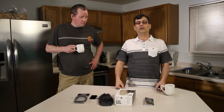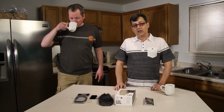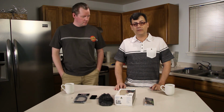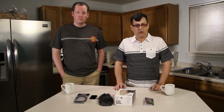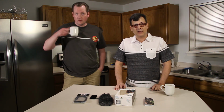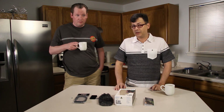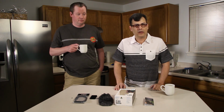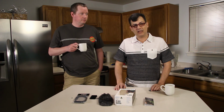Okay, we got the VideoMic Pro from Rode set up on the camera now. There are several different settings. Right now, we have it on full spectrum recording and at 0 dB level. And the other settings that this mic has are minus 10 dB and plus 20 dB, and also a really nice feature that I like about this is there is an 80 hertz high pass filter.